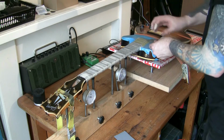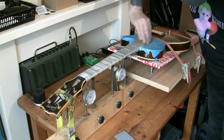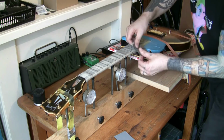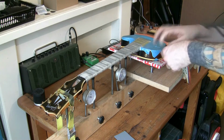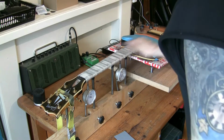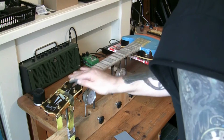But two ways I'll normally come across this way, just soften the edges, and I'll also go this way. And then when it comes to doing the whole of the neck, I'll just go and soften the edges. And then what I do is take my piece of 800 and along the whole length, I just round over this way. And what this does, this does 2 things. 1, it rounds over the edges.